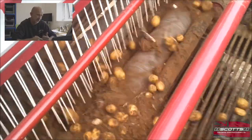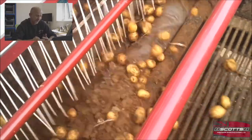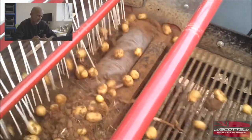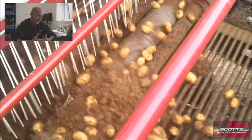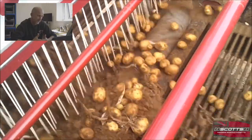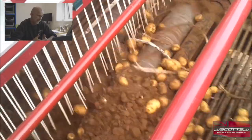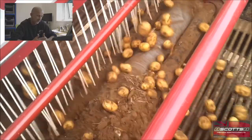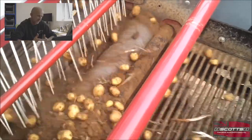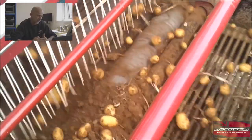The important things to remember from this video: spiral rollers running fast so the crop is staying alive and not settling in the valleys; the clod rollers running in reverse but very slowly — only about 30 rpm. In terms of height, the clod roller is set very low so the crop dropping into the valley can escape quite quickly and isn't sitting there for long periods. Very importantly, there's very little gap between the spiral roller and the clod roller — only about one millimeter. So: no gap, a low clod roller, and running slowly — that's the least aggressive way to run the clod roller.